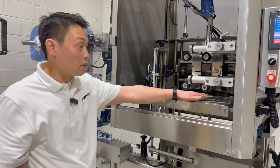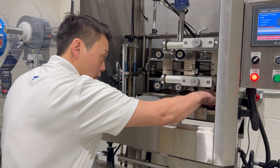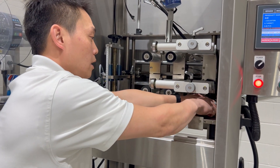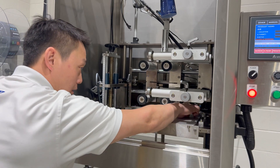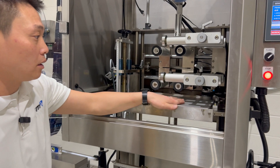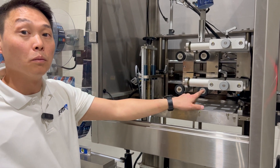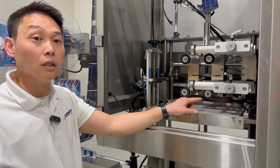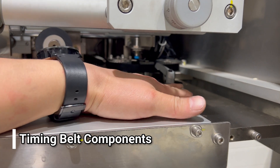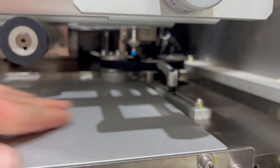Inside, there's a timing belt and a tensioner that we want to make sure is adjusted and tensioned properly. We'll pull the tensioner out and then lock the handle down. You can see where the tab is on the cutter unit and a sensor on the machine. This is the cutter home position switch, which tells the machine where the blades of the cutter are. The tensioner for the timing belt slides in and out and has a sprocket on the end that creates tension in the belt.